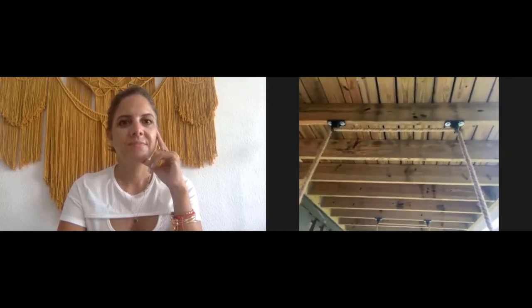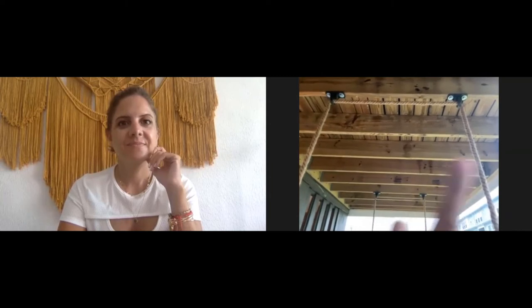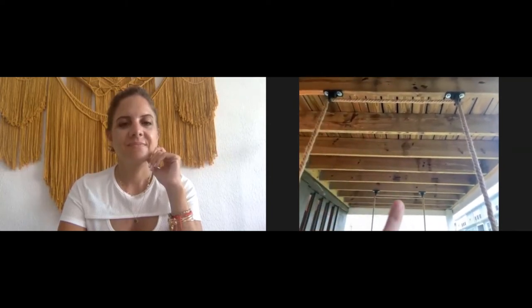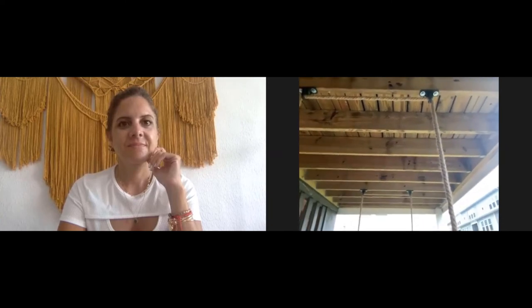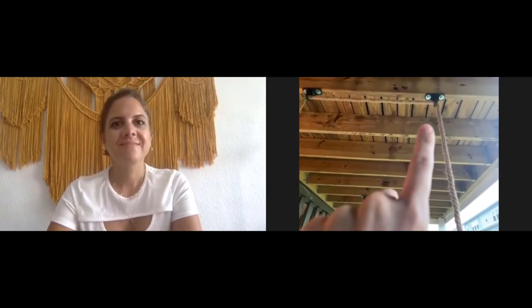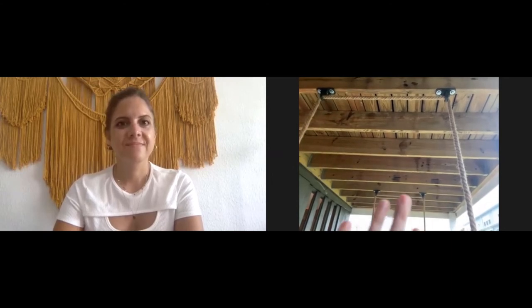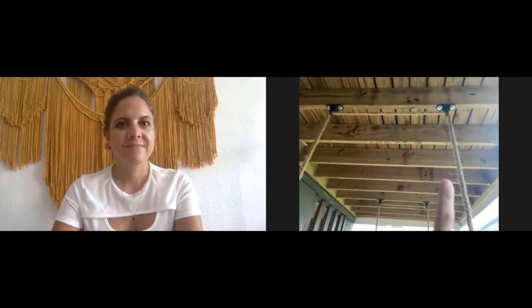Can you see these brackets here? This is a heavy duty swing hang kit that I purchased at Home Depot. It comes in a set of two because they're traditionally used for a porch swing. I wanted four hanging points, so I bought two sets. You can see they're wide enough to go into the joists, and the types of bolts you use are important too. These are heavy duty lag bolts that came with the kit and they're screwed directly into the joists — they are not going anywhere. Another option is eye bolts, which have a loop at the end where your chain or rope would attach.